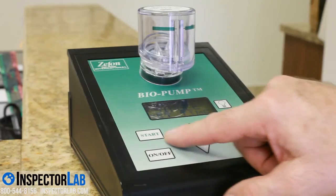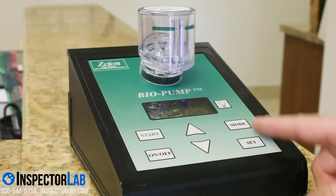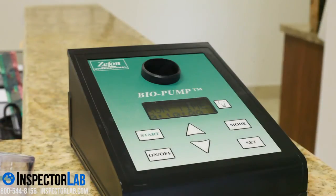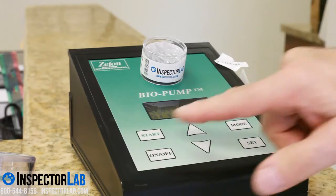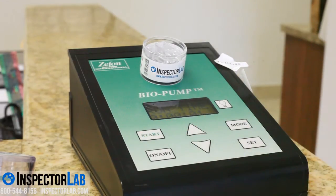To begin taking an AeroCell sample, make sure your clothes and hands are dust free. Dust off your clothes and then wash your hands with soap and water, disinfectant gel, or with an alcohol towelette to remove dust and spores that may have collected on your hands while doing an inspection. Remove the top and bottom white tabs from the AeroCell. Fit the AeroCell firmly over the black gasket on the Biopump, making sure that the airflow direction on the side of the AeroCell is pointing towards the pump — this is the end with the round orifice. Make sure the screen on your Biopump reads Single Sample Mode. Your Biopump has been preset for a 10 minute sampling time in the Single Sample Mode.